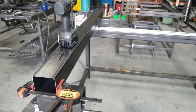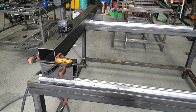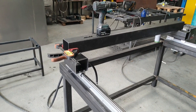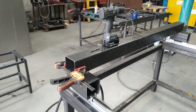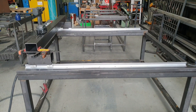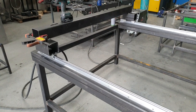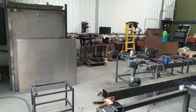I haven't decided yet what I'm going to do with the plasma torch cable. You can put it in snake tray and feed it back to the plasma cutter. I actually prefer to hang it over the top — it keeps it all out of the way, keeps it tidy, and allows you to not have to run cables next to that HF firing cable off the plasma. I'll do a video of the control box. The other thing is this is effectively a 1700 by 1700 footprint — but I'm building one for myself which is going to be 1700 by three meters, so I'll be able to get an easy 8x4 sheet on it.